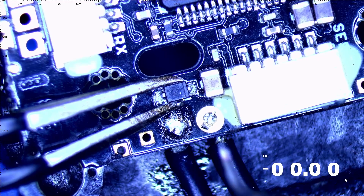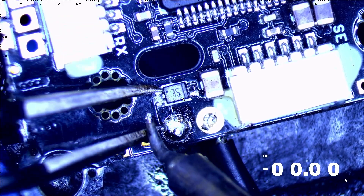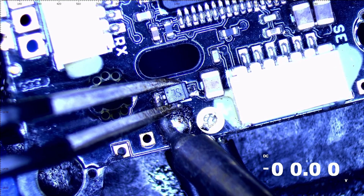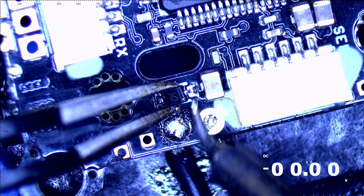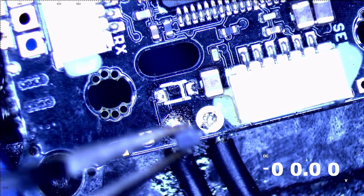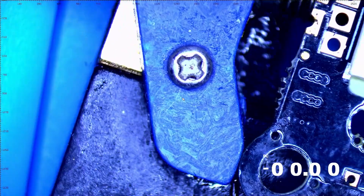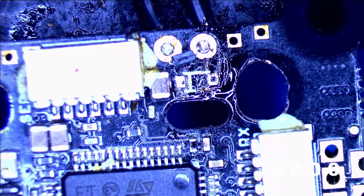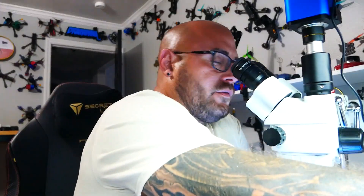I have to put my eyes on the board. We're going to heat that up ever so gently. There it is — I got it. Let's head over to the other board without dropping this. I cannot express how important it is that this is put on in the right direction. It is a diode — it only allows the flow of current in one direction. If you install it backwards, you're going to be in hot water.